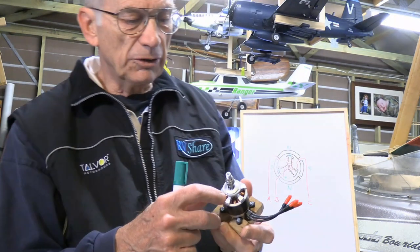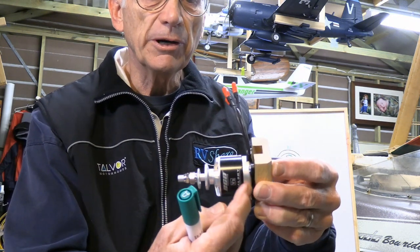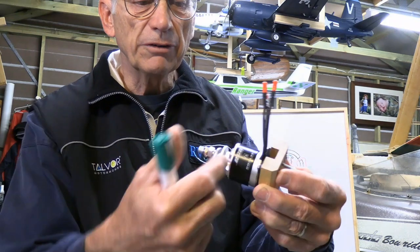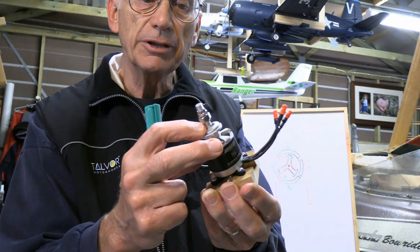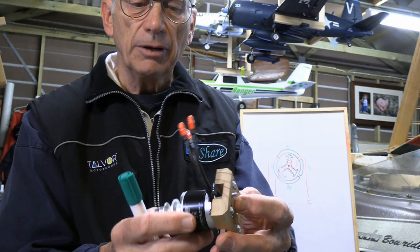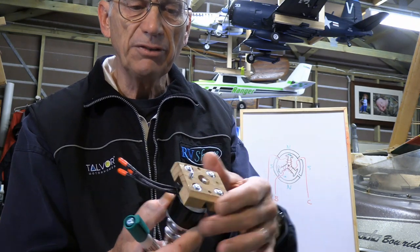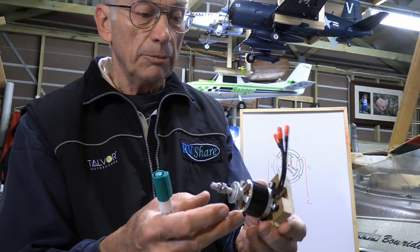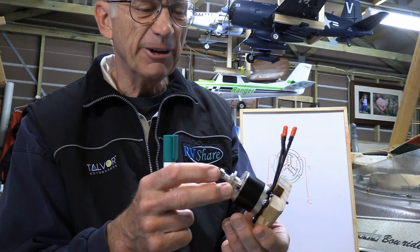The windings are on the inside, with wires running behind the rotating part. The silver part here is fixed; the black part is rotating. The wires are fixed onto the windings, and the case — the part the prop is attached to — turns. On this particular motor, it also turns a shaft on the back, which could be useful for ducted fans, boats, or cars. For an airplane it's not really doing anything, though you might run a fan on it if you had a heat problem.